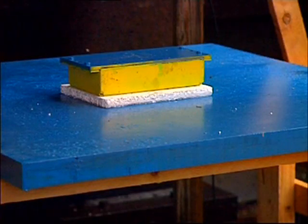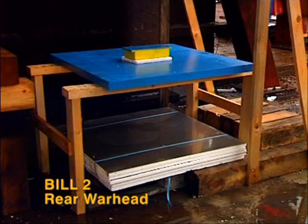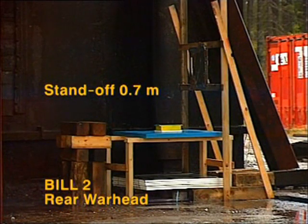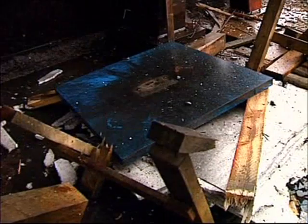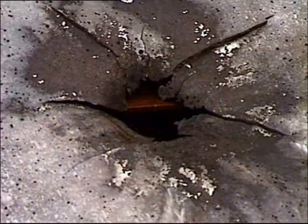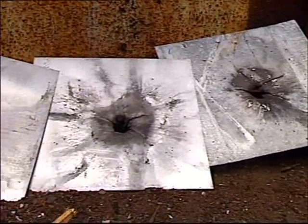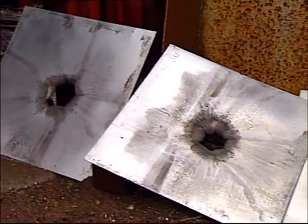The next dynamic Bill 2 firing, now using only the rear main charge at a standoff of 0.7 meter. The target arrangement is the same as in the previous firing. The ERA has been detonated and neutralized, and the 50-millimeter armor plate penetrated. The effect in the witness plates shows that the Bill 2 main charge alone is capable of striking through an advanced MBT turret protected by ERA.